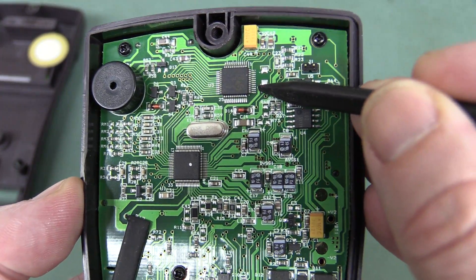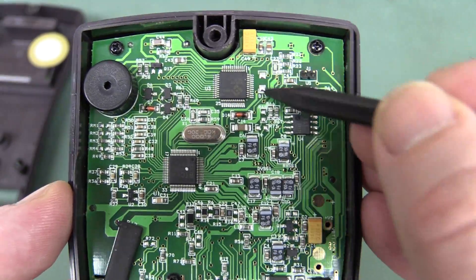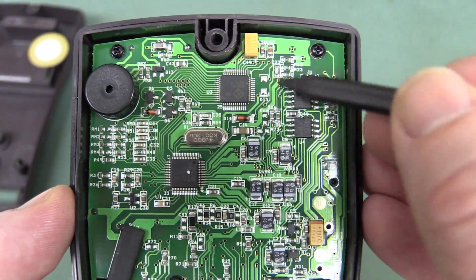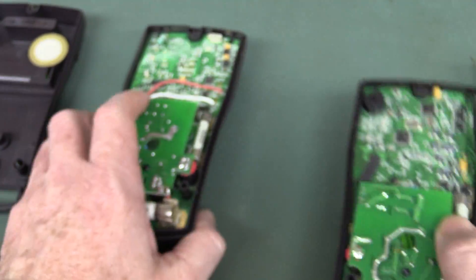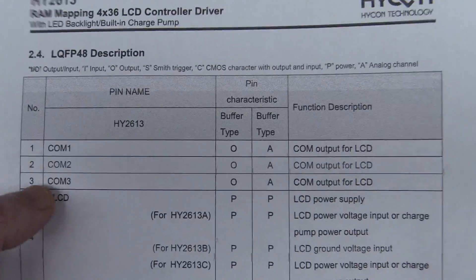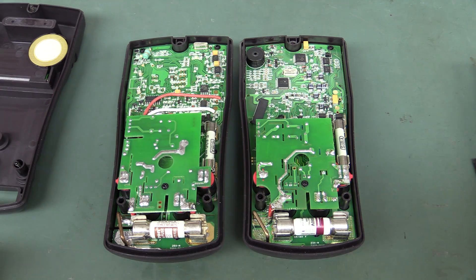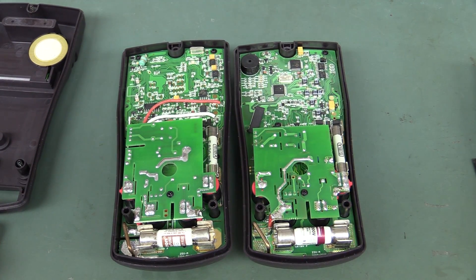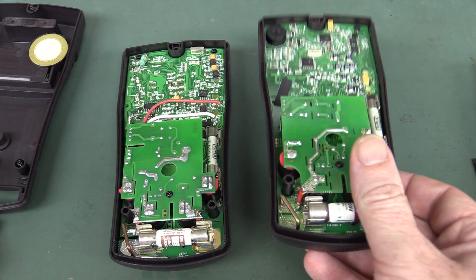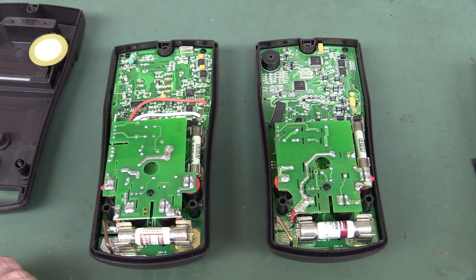So they've got that going to a rail there, whatever rail that is - a positive rail presumably. They just left that part out, it just happens to be in the same location. I'm afraid I don't even have to probe that one with the scope to know that's not going to work, because we have the datasheet. It's a charge pump - it's just a coincidence. So there you go, six minute video to tell you that. This thing has no secret serial output hack, I'm afraid. Catch you next time.